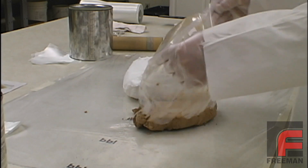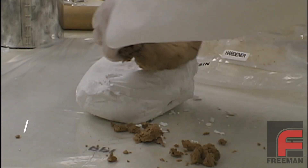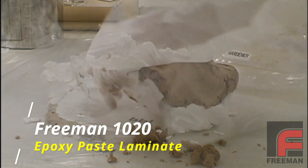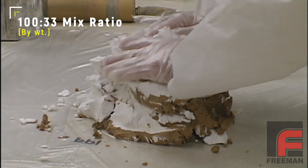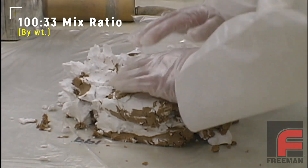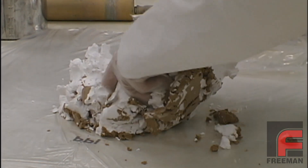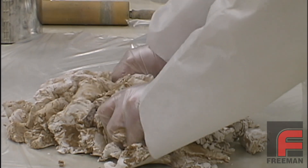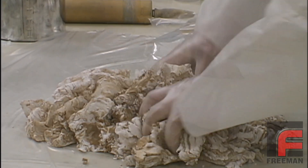After three layers, we are now ready for the paste laminate material. We are opening our packages of Freeman 1020 on a plastic covered table. Since each gallon kit will cover about 420 square inches, we know this project will require more than one gallon kit. So we begin by mixing the entire bags together without having to weigh the material. When we require less than one full kit of material, we will weigh the material using 100 parts resin to 33 parts hardener.